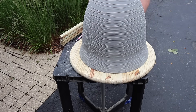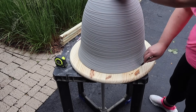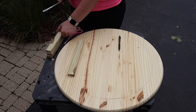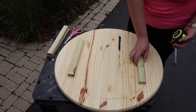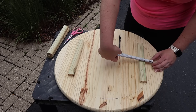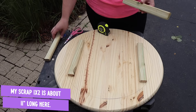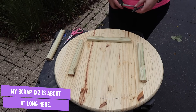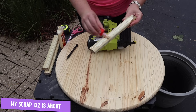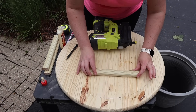I'm going to get my pot set on the bottom where I want it, trace it on the wood, and then use that initial measurement to lay out my scraps. These were from my recent fence picket video, so I just had them laying around. You could also use scrap from the value wood section, check around for pallets or extra wood, or you can buy a 1x2 as well. I'm using my 2 and 7/8 inch measurement for my container and marking it — the key here is you're going to use wood glue and some nails.